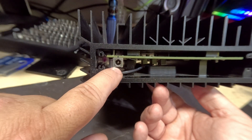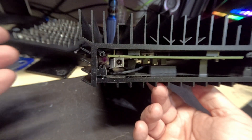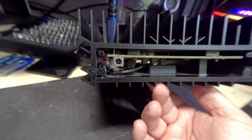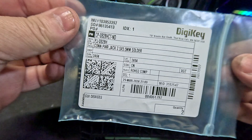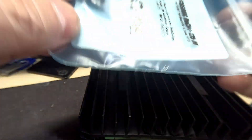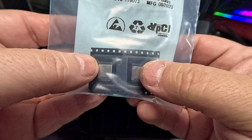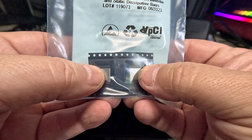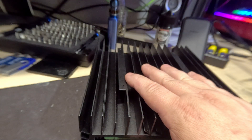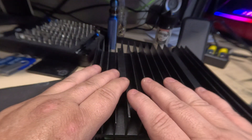Thankfully, the center pin just came out. His son accidentally knocked the cable and it came right off — that was the end of it. No big deal, no fire, no smoke, nothing. So what we're going to do today: I have right here from Digi-Key — you'll want to pause and get the product number off it — replacement barrel jacks. Never buy just one; always have a backup in case the first soldering doesn't work correctly. These are only about $2 or $3 each from Digi-Key.